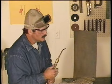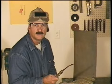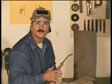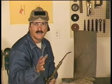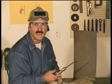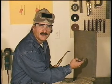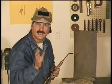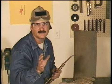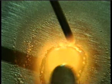On vertical welds, we'll start at the bottom and weld up. And these are real easy with oxyacetylene. For one thing, the metal is preheated because the heat's rising, and the weld will progress a little faster. Now, if you can picture yourself turned on your side, a vertical is just like a flat weld. I know a lot of people don't want to believe that and think the metal will drip down, but it doesn't want to. As long as the puddle's not too hot, that metal wants to stay there. It likes the heat. Angle the torch up and keep the inner cone off the metal.